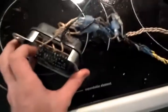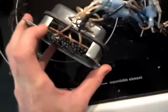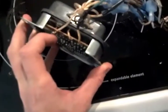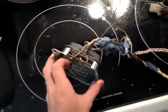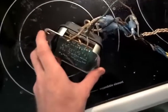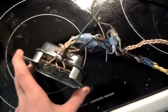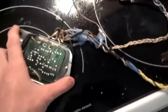When I decided to move the circuit board from one side to the other, I got rid of the connection that was made internally from the post that held the board in place — from the collector, which is actually the case of the transistor — and brought it up to the PCB. So I made a wire jumper. It's not pretty, but it works and it's not going to fall apart. I may get around to making it look a little better in the future.